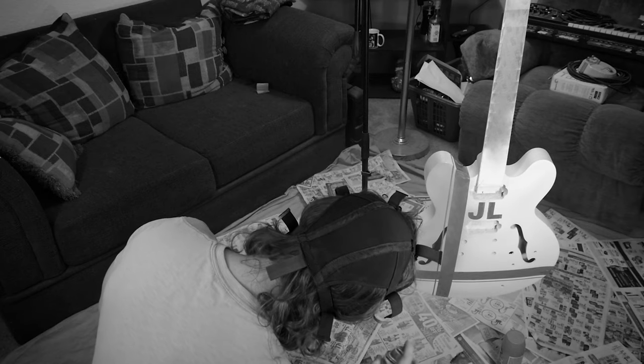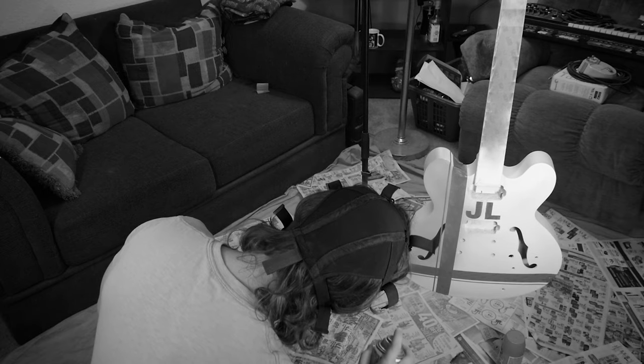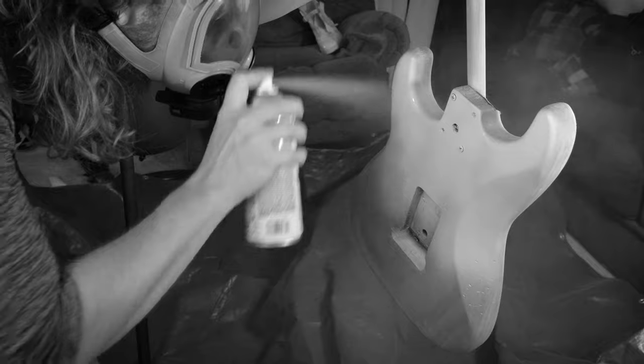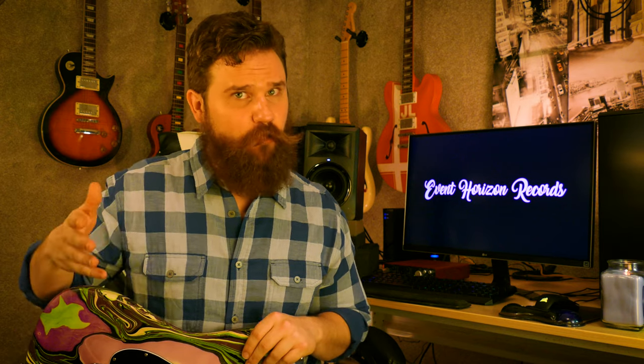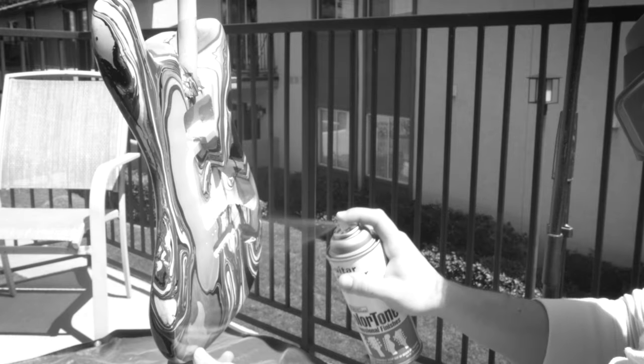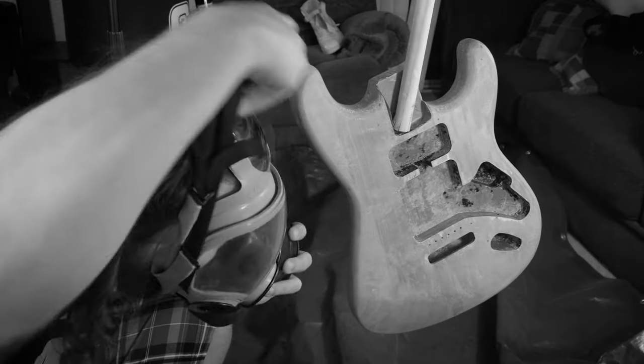In my previous ES335 video, I had some comments about me painting indoors. I had to do that with this one as well. Ideally, that's not the case, but my job did not allot me any daylight to work with. I laid down a tarp to catch the wet overspray, and anything atomized actually gets sucked out with the exhaust or dries in the air and settles, and it's nothing a dusting or vacuuming won't take care of. So yes, ideally you paint outdoors, but if you do it indoors, wear a respirator and just be aware of those consequences.